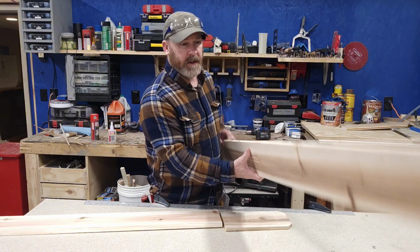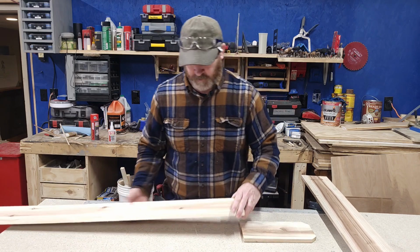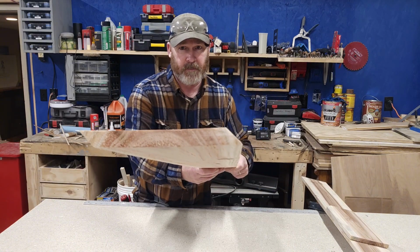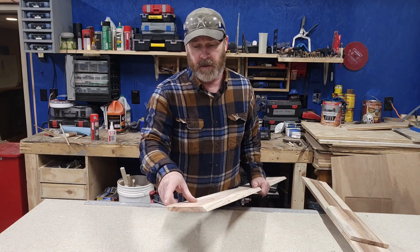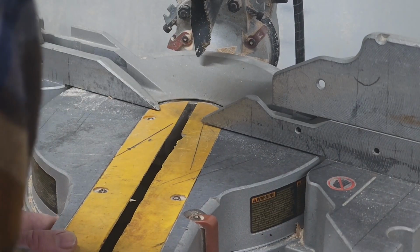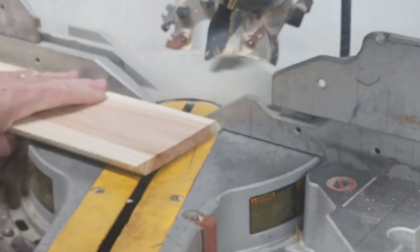Okay, you're going to start with your 2 pickets, set one aside. Now we're going to cut the other one at 61 inches. Set that other piece aside, and you're going to bevel 45 degrees. Should look like that. This is for our roof section. The miter is going to be 22.2, and your bevel tilt is at 20.7. Tilt your blade to the right. The first one, we'll just cut the tip off.